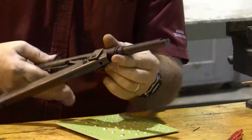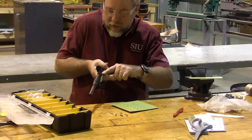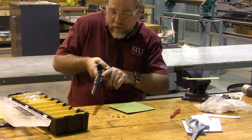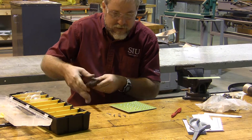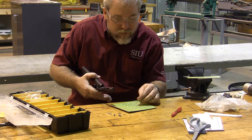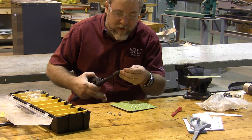Now to use this machine I need to get it ready to pull again, so I hit the release lever and you'll hear a click as it shoots forward, and now we're ready for our next rivet. I'm going to install two number one rivets, three number two rivets, and a number four rivet.